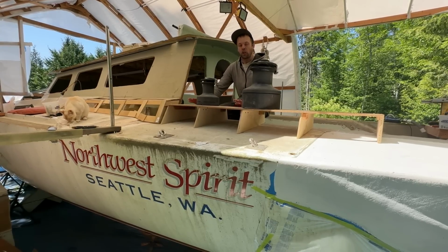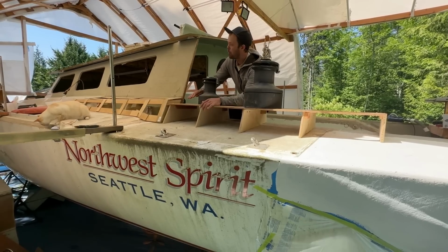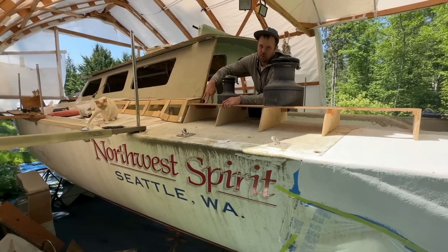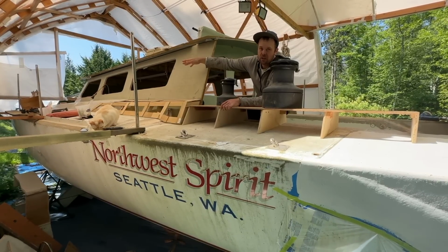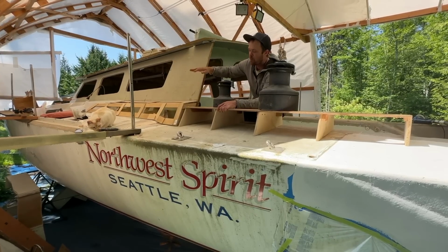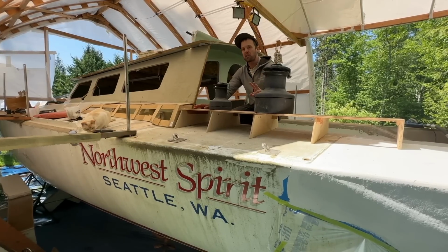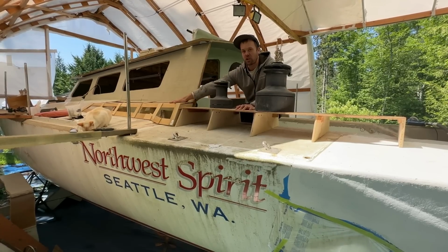And that includes having to blend the combing into the boat by extending the cabin top, which is forward, back to the combing. There's going to be lines coming from the masts, halyards, reef lines, and stuff like that, coming down along the doghouse on top of this raised cabin top back to the combing. And so there's two parts per side that I have to build. One is the combing, and then one is the extension part.